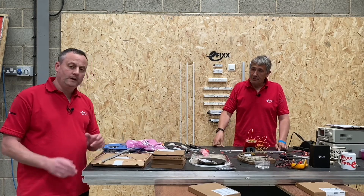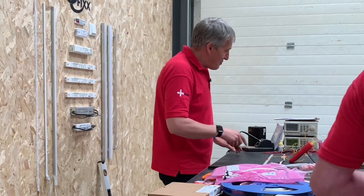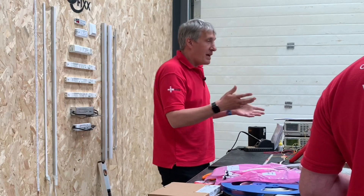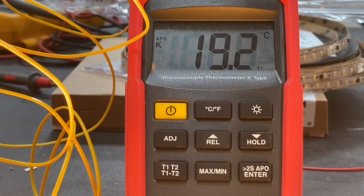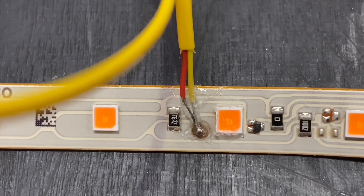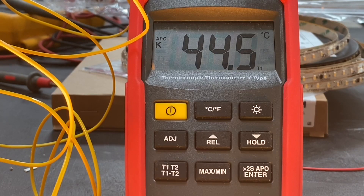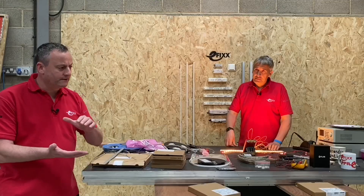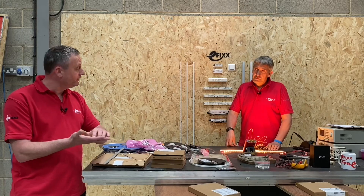No doubt you're going to prove that having the LED strip in free air is going to be considerably cooler than encasing it in all that metalwork — well, we'll see. So I'll switch it on. Temperature in here is about 18 degrees C. I'll bring on the power supply and let them warm up. You'll see the temperature is already rising quite quickly. We're measuring the temperature directly on the TC point of the strip currently in free air and it's escalating. We're going to compare the difference between the two strips.